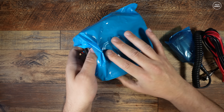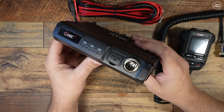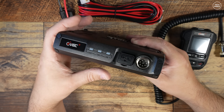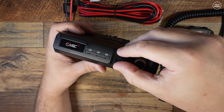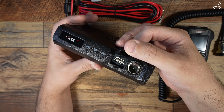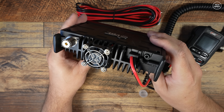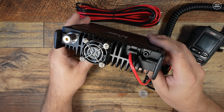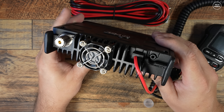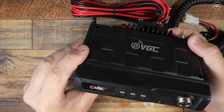If you've never seen one of these types of radios before, this radio can be completely controlled via an app on your phone or tablet. The connections on the main radio itself are quite limited, with just a microphone socket on the front, a USB power socket also on the front alongside a few status LEDs. On the rear of this chunky heatsink chassis you'll find an SO239 socket for the antenna and a 3.5mm socket for a speaker.